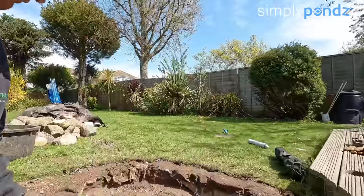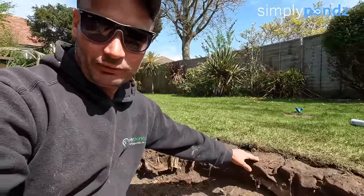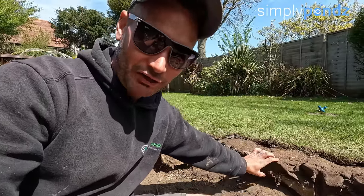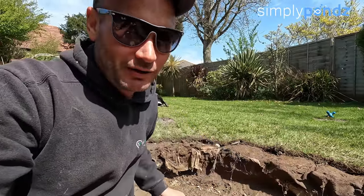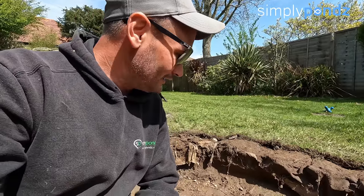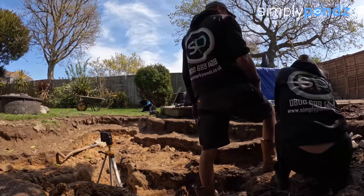Okay, so how do we level it off? Basically the concrete blocks are about 100 mil deep, so we find the lowest point on the pond, which is probably this little area here. So that's the lowest point. We measure 100 mil down from here plus a joint for cement, so maybe about 120 mil to give it a nice thick base, and we'll get the laser on that line, 120 mil down from here,